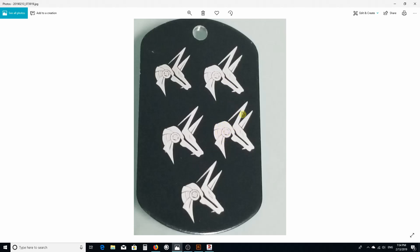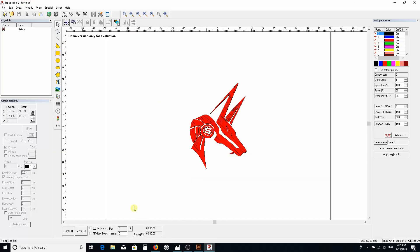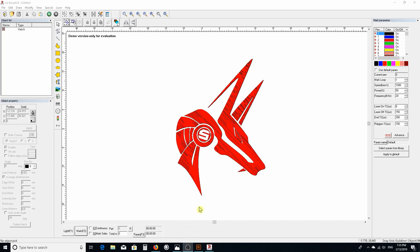The problem with the hatch pattern being off is that when you make the artwork smaller the problem gets compounded. Where you're supposed to have a clear black line, it's completely gone because it's washed out by the overlap — you lose all the detail. Lesson learned: don't engrave the customer's final product until you've done it on scrap and tested it to make sure it comes out clean. And when I say scrap, I mean a lot of scrap, until you get it right.